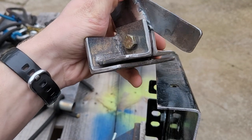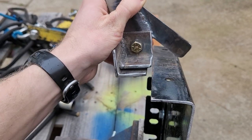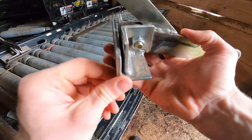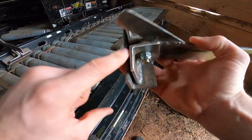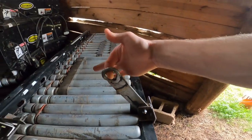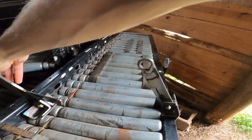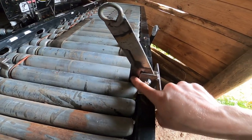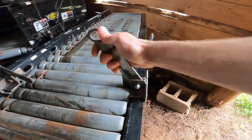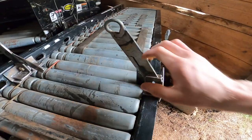A much safer option for lifting overhead is a couple of these on either side of the conveyor. It has a gap that slides into the frame and then locks down as your rigging comes up at a 60-degree angle, so that flat bar goes between the rollers and prevents it from sliding left or right, and while you're rigging up prevents it from sliding out again.